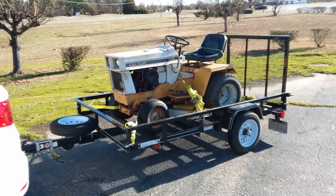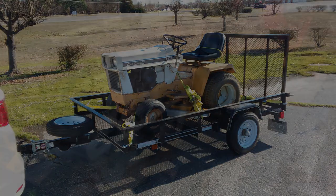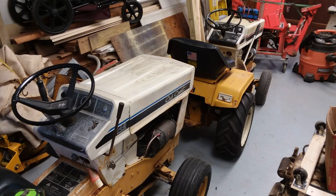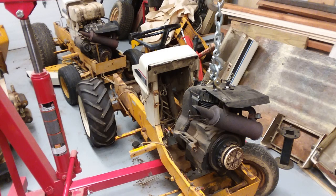Here's a model 149 from the early 1970s — I'm bringing it home, and this is one of the two tractors which will be donors for the motor grader. The other tractor is a 129. Here's the 149 in the foreground and the 129 in the background. The 149 has the auxiliary hydraulic ports on the hydrostat so that makes it capable of operating all the hydraulics on the motor grader. So here are the two tractors — I'm beginning to remove the engines, starting disassembly of the tractors.